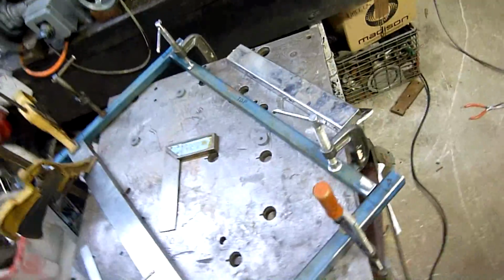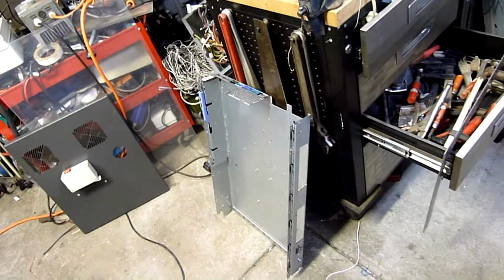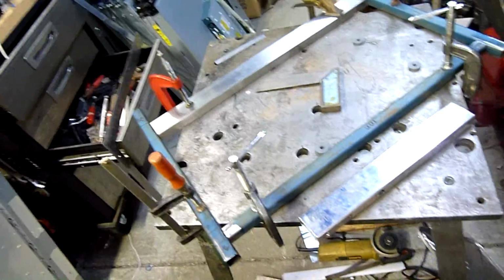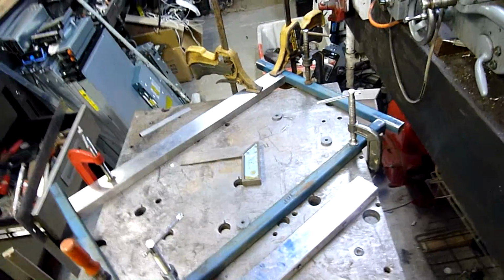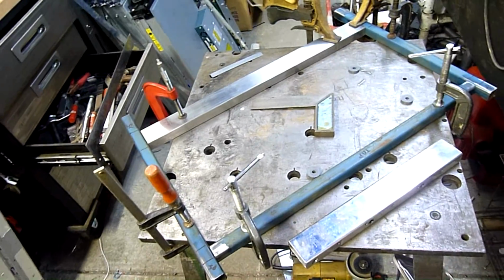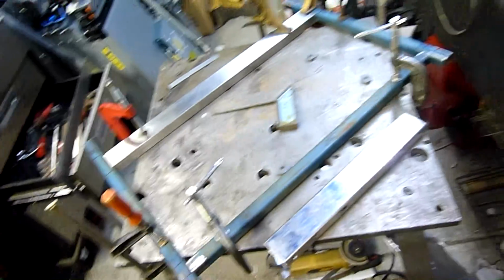There's going to be welds, there's going to be burnt zinc. Being zinc plated, it's going to burn when I try and weld it. Probably means grinding the area back or just putting up with it. It's going to get a little bit messy, but overall not diabolically bad. So yeah, better turn on the TIG welder and go to it.